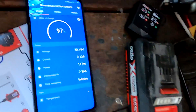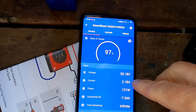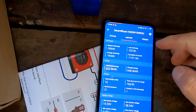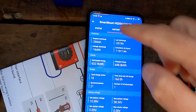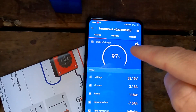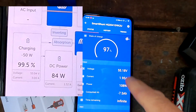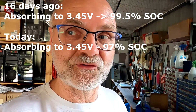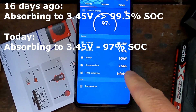I expected some drift, but the question was how much. Currently in the smart shunt we are at 55.2 volts holding the voltage, still charging with 2.2 amps going down gradually. From the history, it's exactly 16 days since we fully charged and calibrated the smart shunt. In theory it should sit on 99.3 to 99.5% — but we are over two percent down. The smart shunt shows two percent less energy than two weeks ago, and 7.5 amp-hours less.